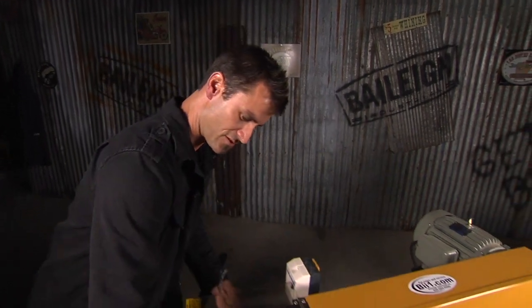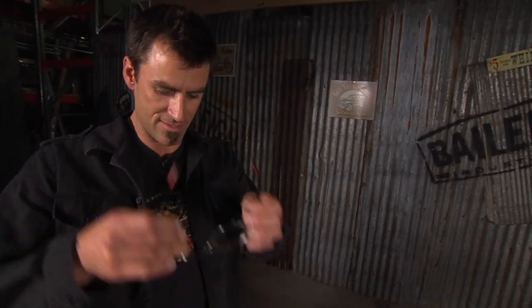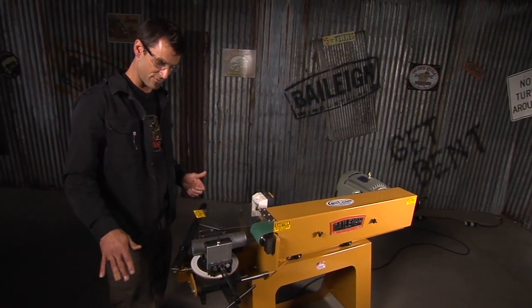The reason, come to find out, is that if you're going to use thin wall tube, if you put an end mill on thin wall tube, because it's really thin, it wants to grab it and move it and shake it. So if you do more thin wall, you can use a notcher like this. You can do thick too, but this is the reason you'd want to use a sandpaper type versus the end mill.